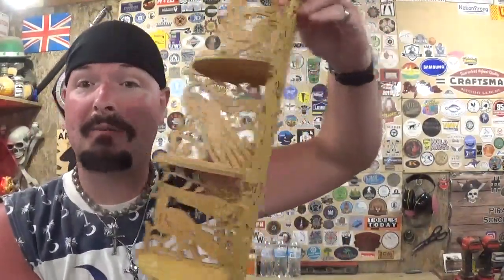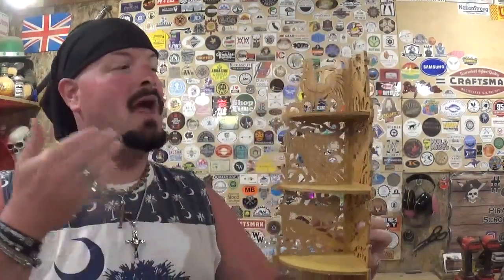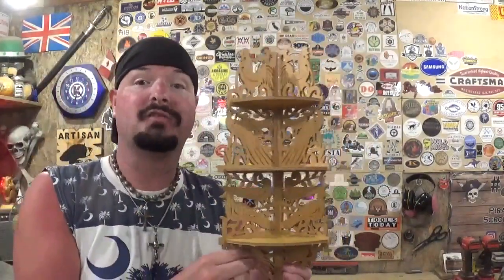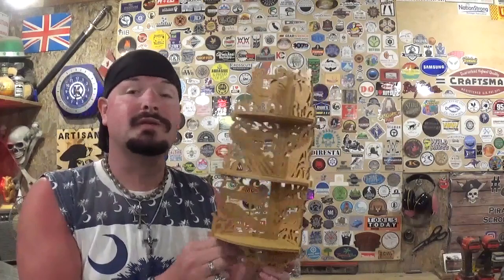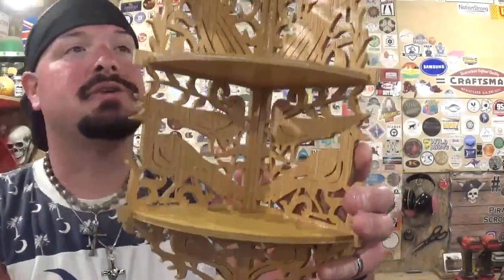With stack cutting, both the front and sides came out nice and uniform and symmetrical, as they're supposed to in a shelf like this. I alternated wood glue and CA glue on the shelves — the CA glue provides the instant bond and the wood glue locks everything in overnight. The shelf cavities are about the size of my fist. I could see some shot glasses or little bird figurines going in there, or maybe some 3D printed items. This shelf is probably ultimately going to go to my aunt who decorates with birds — mainly chickens and roosters.